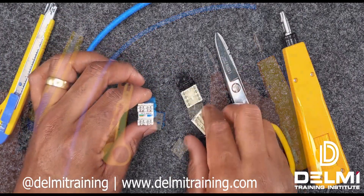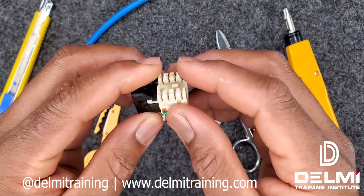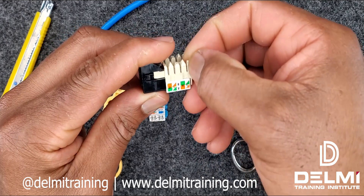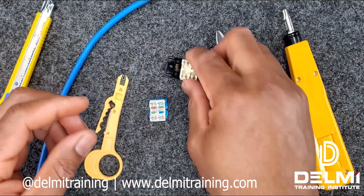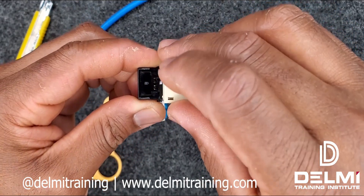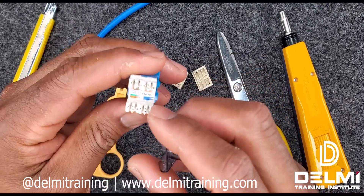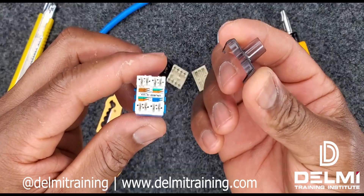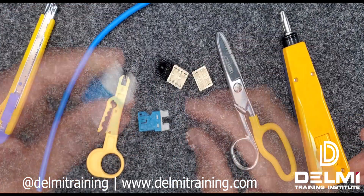I don't recommend it, but if that's what you have, be careful. I'm going to be using two different types of CommScope jacks. This jack allows for both the 568A and 568B termination, so it has two separate color coatings. For the 568A, white orange and solid orange go here, white green and solid green here, and the blue and brown pair on that side. It also comes with a retaining clip that you securely put on once termination is complete. This other variation of CommScope jack also allows 568A and 568B and comes with a cable retaining clip as well.